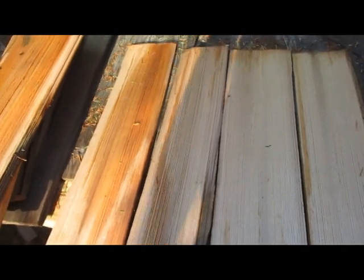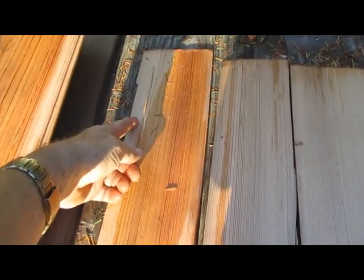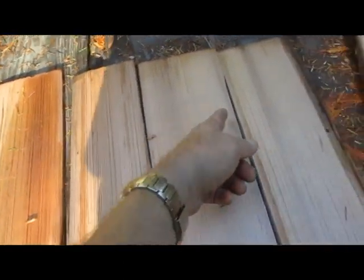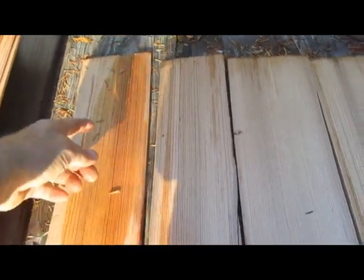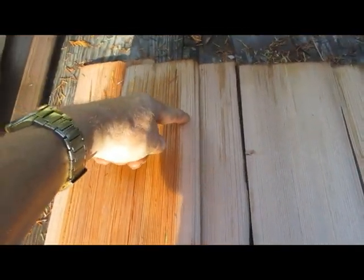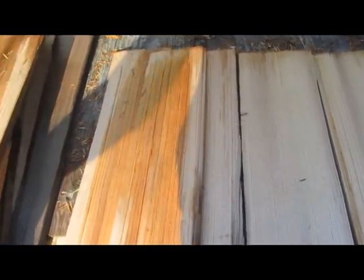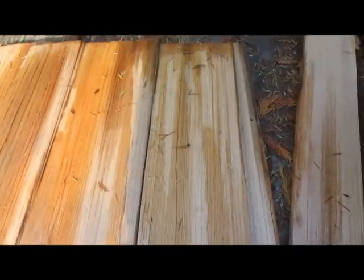For nails, you go up in this area and put one-two nails per shingle. On the first course you can get by with just one nail because when you put the next course in the nail goes through both of them. For the second course, put two nails — although in a lot of cases one nail works fine.